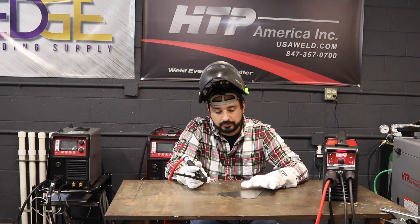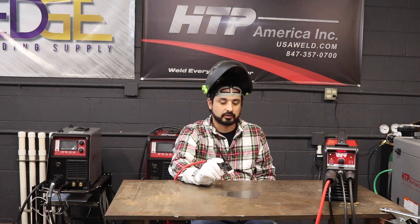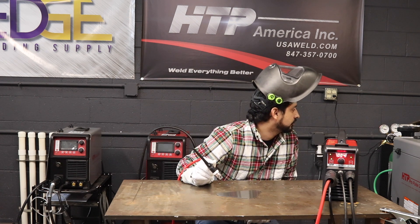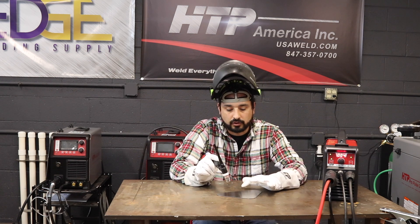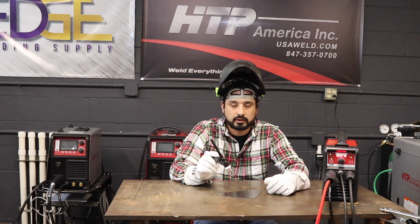Today I'm going to be welding some 16 gauge 304 stainless. I'm only doing just a little bit of runs. Normally I would be wearing a respirator, but since we're only doing a little bit I'm going to skip it today. As far as argon flow, I'm going to be running roughly about 25 to 28 CFH. That's linked directly to this valve, so the moment you crack it you'll hear the gas flow. To initiate the arc start, you're going to have to hit the pedal down, touch and lift, and that will get it to fire.